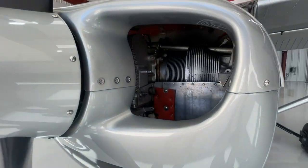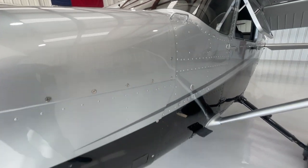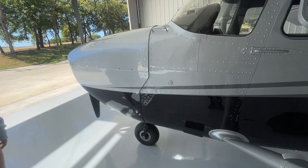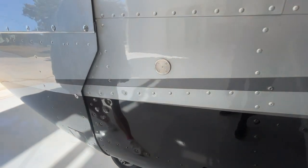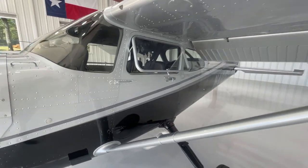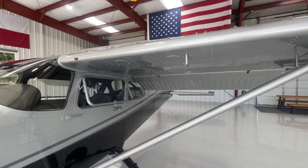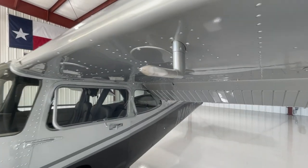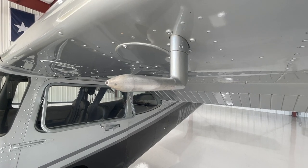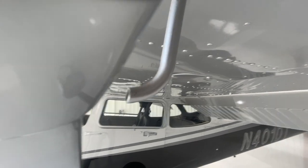Checking inside the cowling on this side, make sure all fittings are in place and all screws are securely holding the cowling on. On this side of the airplane, we have the static port — make sure the hole in the port is clean and there's nothing blocking it. Inspecting this wing just like the other wing, the difference here is we have the pitot tube on the left wing — make sure it's clear. There is also a fuel vent on this side that should not be obstructed.